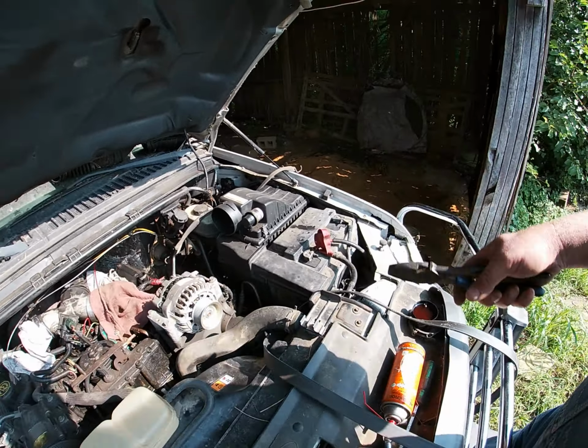These pulleys, have a listen. Kind of sounds a little dry. And that one sounds a little dry. And that one over there sounds a little dry. So it's gonna get a new idler and a new tensioner. The whole tensioner assembly is 70 bucks. The pulleys on the tensioner are $55. Kind of hard to justify doing just the pulleys on it.